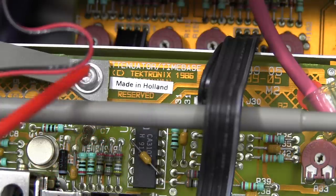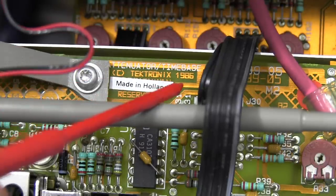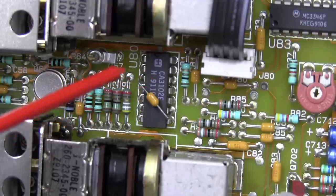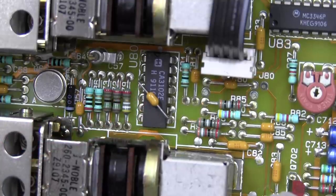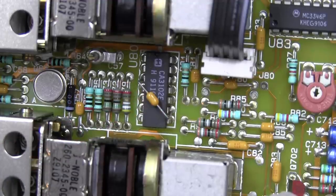And there's something you don't see every day — made in Holland. Copyright Tektronix 1986. So at least this vertical attenuator and time base board is made in Holland — maybe the entire scope is manufactured there. Copyright 1986 gives us a reference point for manufacture. It would have had a decent product lifetime of five-plus years. There's also some decoupling on this particular chip, duplicated on both channels — maybe an afterthought, or maybe it was so critical they had to get the cap directly on the pins of the device.